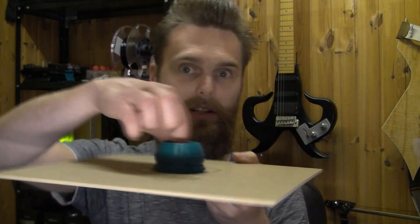I found out what I did wrong. I made a second hotend holder — a full metal one — but I also use the stock Creality hotend. With the stock one, the Bowden tube goes all the way through, but with the full metal it doesn't go as far. I hadn't pushed the Bowden tube in far enough, so I had heat creep and that caused the blockage. Now I've resolved that and I've finally printed this, and the result is stunning. Let's see how well it's stuck to the build plate — I haven't used glue, 3D-Lac, or any substance. It's just plain MDF.